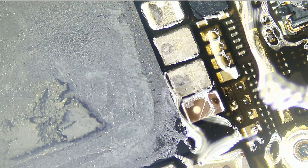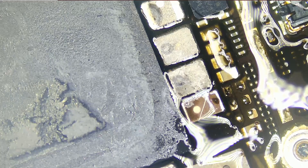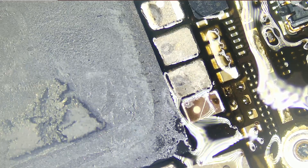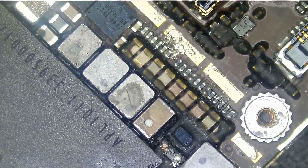Do not want to apply a lot of solder onto those pads, because if you apply a lot and you put the capacitor on, the solder may touch the small tiny components that you see on top. So this amount of solder is very good. This is the donor board here.